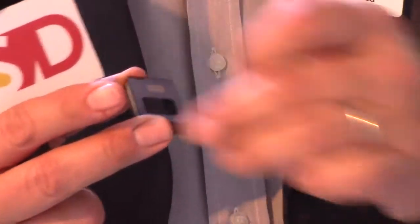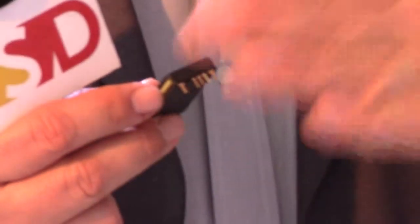The PC board is a large panel which is completely overmolded and then singulated, like you would singulate individual dies from a silicon wafer. Once this process is done, all the contacts appear on the edge of the PC board as copper layers, and that is where we do the physical pin attachment — so all the surface is dedicated to the power components. This package is completely symmetrical: you have power components on this side and the same amount on the other side, with the ferrite main transformer surfacing on both sides.